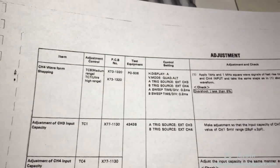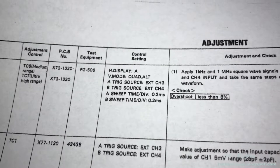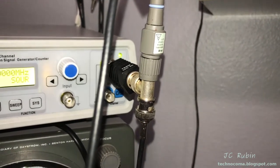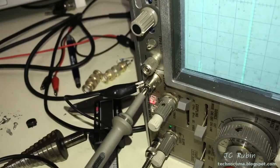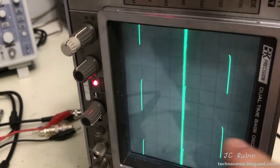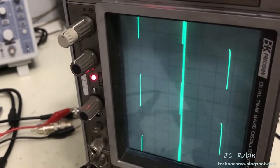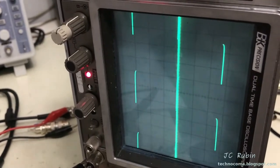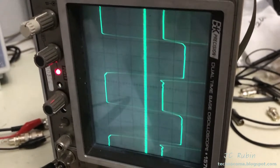These efforts are essentially repeated for channel four. One note: there's no A trigger source for channel four, so you have to use the signal in channel three as the A trigger source, and the B trigger source is channel four. I couldn't find my other coax cable, so embarrassingly I used my oscilloscope probe off a T connector, ran it into channel three, and connected it like that — but it worked well enough as a trigger source. With all that, we got channel four looking good, with channel three visible off to the side. Moving on to 1 megahertz — that looked good as well.